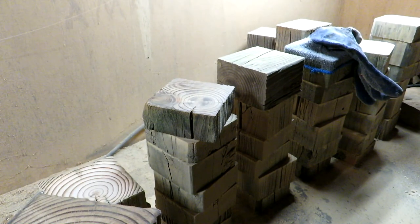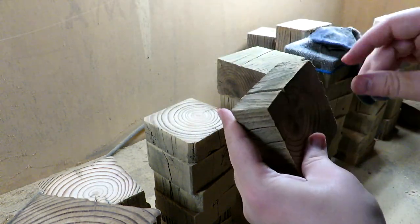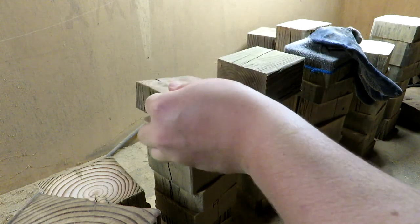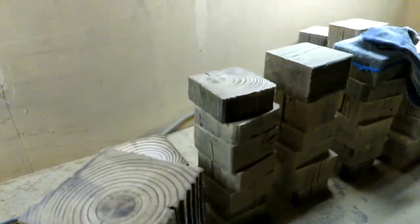Can I just get a job where I get to stare at wood cross sections all day, because this is really awesome. All of these are sanded on one side now — I picked my favorite side of each one, sanded it, and basically now at some point I'm going to have to take a toothbrush and just brush all the dust out of the cracks and off of the sides. I will have to cut the backing boards down — I cut them for 6x12, so I'm going to have to cut those down to 6x11, and then I can arrange these in the order that I like them. I hate putting things together primarily with glue, but because these are old boards, they would crack and split if I tried to put screws into them, even if I pre-drilled.